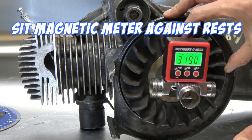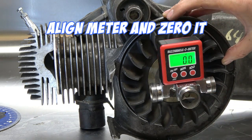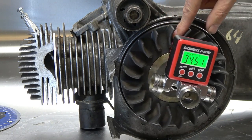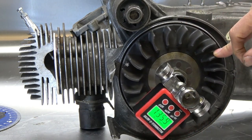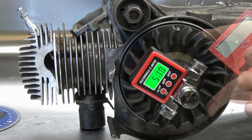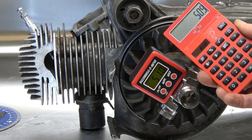Next, fit the buzzwangle-o-meter, which is essentially a digital inclinometer. Set it so it rests against the stop in the most anti-clockwise position and press it twice to zero. Now rotate all the way around until we reach the other stop, and it reads 50.9 degrees.